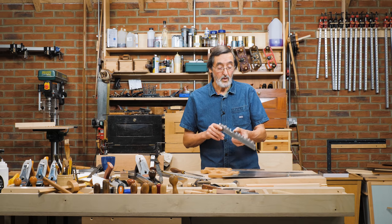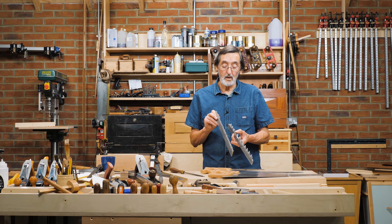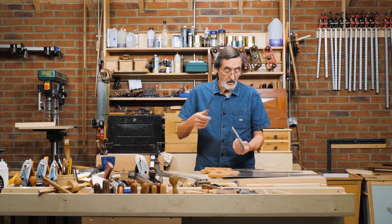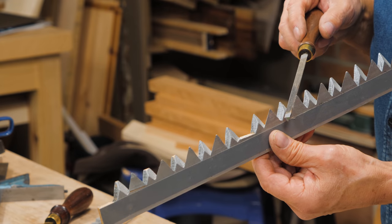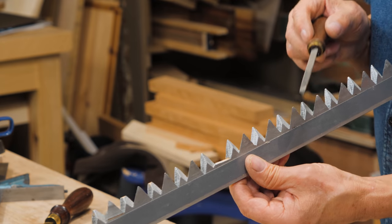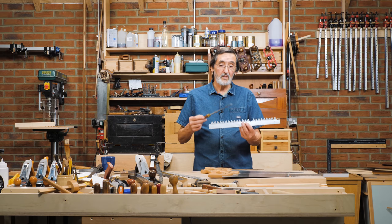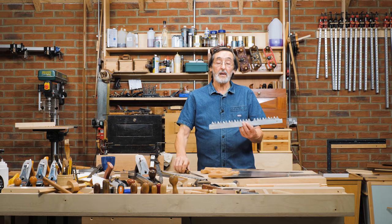When I come to the cross-cut, it's very different. I might start off by shaping the tooth just like a rip-cut pattern, but then I have to go into the gullet. I sharpen going this way, skip the next tooth gullet, go into that one and file it, skip a tooth, go into the next, every other one — and then I turn the saw around and sharpen the ones that I missed. I've now changed the position of my hand; instead of going one way, I go the other way, and that's how I get this pinnacle tooth.